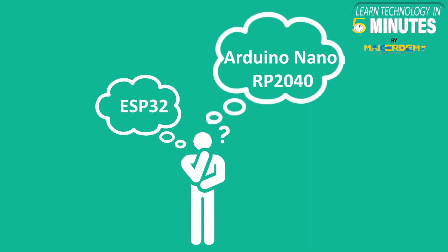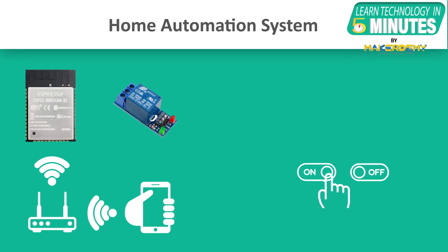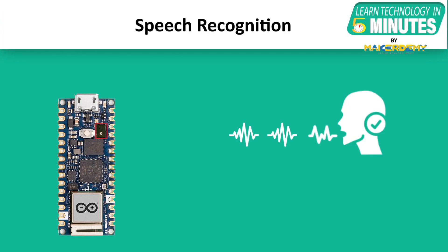One of the best ways to know which board is right for your application is to see the potential applications each board is suitable for. First, Low-Power IoT Data Loggers: it requires monitoring the environment and recording data on the cloud, which can be fulfilled with ESP32 in a very cost-effective way. Second, Home Automation Systems: we need a couple of relays and Wi-Fi and Bluetooth connectivity only, so ESP32 can do the work very efficiently. Third, Speech Recognition: an inbuilt omnidirectional microphone IC with a cryptographic processor on Arduino Nano RP2040 makes it capable for securely storing keys, and its dual-core processor makes speech recognition happen in real-time.